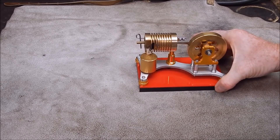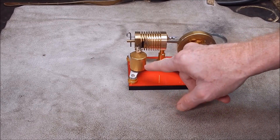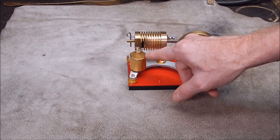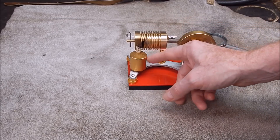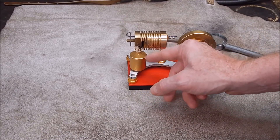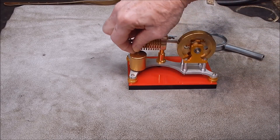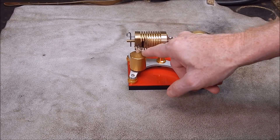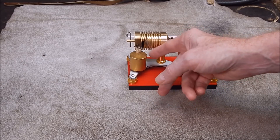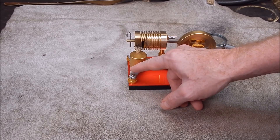Later on I want to do something about the little pot here for the metho. The wick is actually too high — somebody else pointed it out and said the flame is all coming up here. The whole pot should be sitting down lower, and the pot should be bigger because it just doesn't last very long — only about 4 to 5 minutes. Also the pot doesn't have a spout on it, it's just a hole. What happens is the flame heats up the lid, it boils the metho, and then the metho expands and spills out and you finish up with a flare-up. So a new pot needs to be made completely, I think, to do it properly.